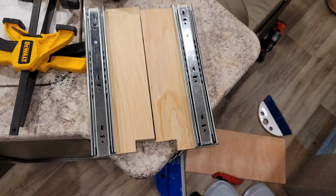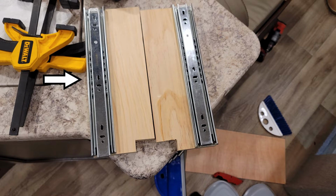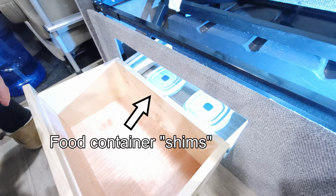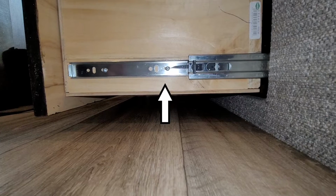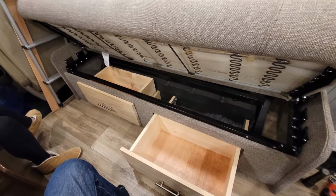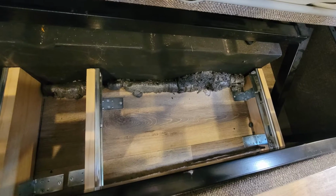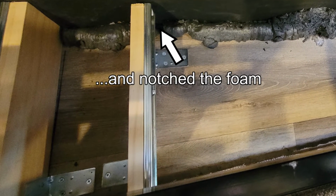So to solve the first problem, the wood pieces we attached the rails to got notched, and we attached the cabinet member portion of the drawer slides to the very top of the wood. Then we mocked up the drawers at the height they needed to be, and marked the drawers with where to attach the drawer member, then attached said drawer members. With the mock-up, once we got a good idea of where all these components should end up being to enable reasonably good drawer operation, we screwed the notched pieces down into the floor using double-wide corner braces.